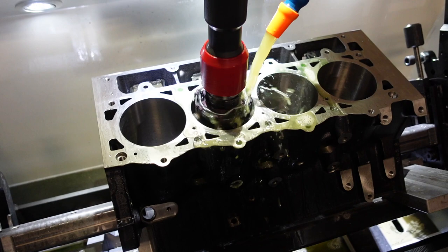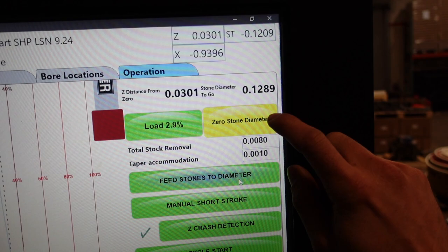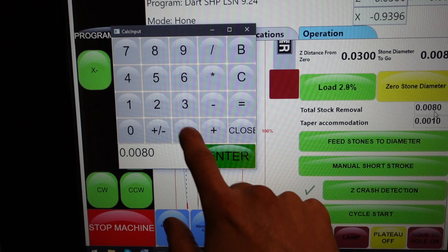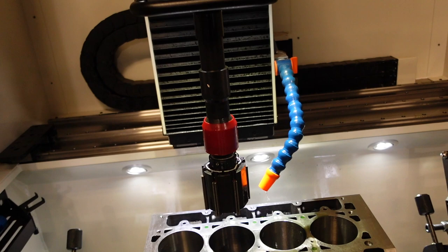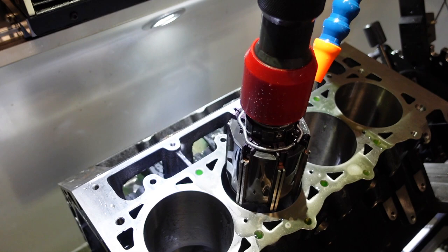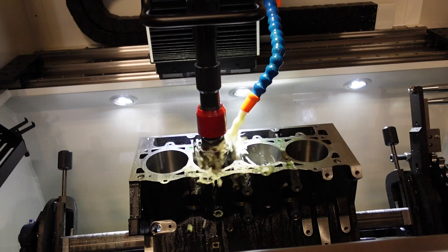So it wants to hone out 128 thousandths to go. First I'm going to zero my stone diameter, and I'm going to tell it to knock out — we'll start with a hundred thou just to get it running. Cycle start. It's going to come back down, and if I did my job correctly it'll go right in the hole, feed itself to diameter again, Z crash detection clear — and we're roughing.